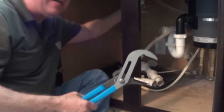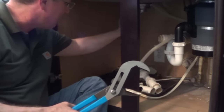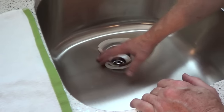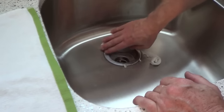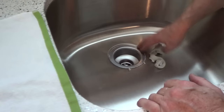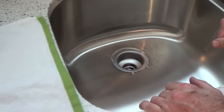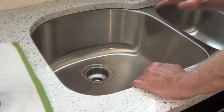For a project like this, you're going to need a sink basket tool that grabs onto the little tabs, or large adjustable pliers. Once you tighten down the nut, you'll force out the excess plumber's putty and just wipe off the excess. That plumber's putty is your gasket underneath the sink basket. And that's all there is to installing a sink basket.